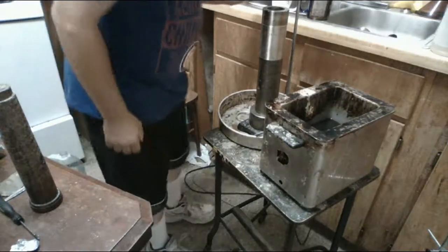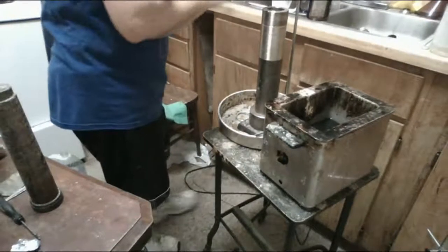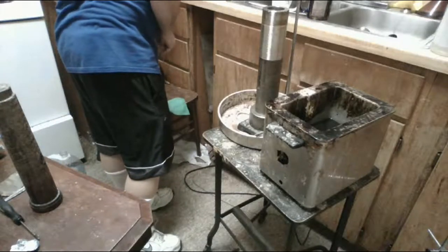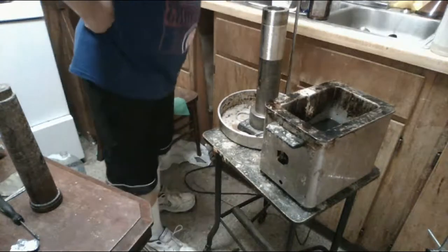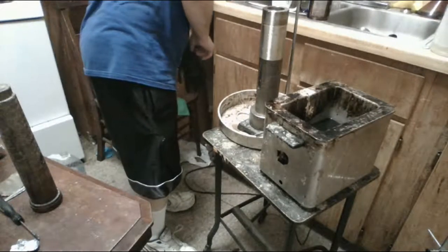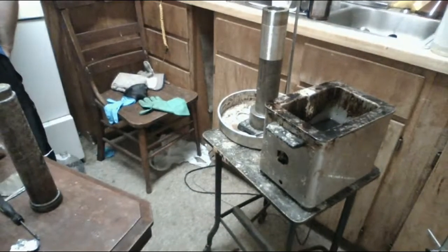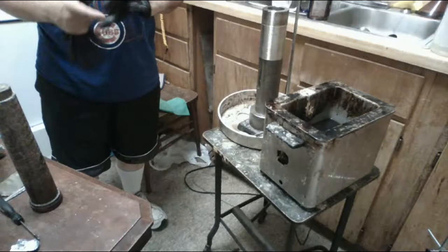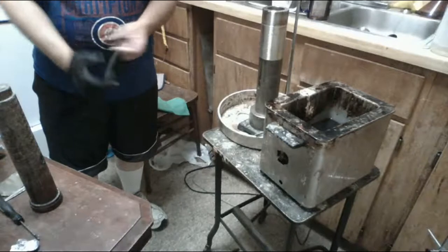Again, I'm watching it. We are solid. I'm going to remove the top here so you note how... Huh? We've only been 5 minutes? No, this will be 10 minutes in the mold. But I'm going to remove that. That'll help us determine where we're at. The mold temperature was 250 degrees Fahrenheit. The mold was brought up to that temperature.